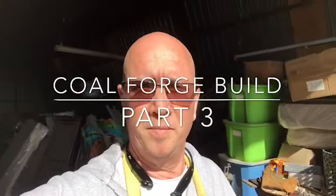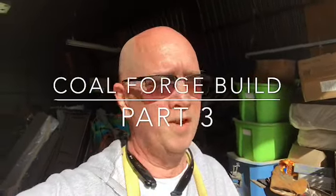Just working on a few things, a couple upgrades or finishing touches that I was supposed to be doing to my forge that I've been putting off. So now that I've created several pairs of tongs, I'm going to have to add a little handle spot or a bar across the side of the forge to hang my tongs on. And I never did extend the handle on the clinker breaker so that I could reach it from the front side of the forge. So I forged a couple pieces for that today that I'm gonna attach to the forge, and then I'm also working on another pair of these quick tongs that need to be finished off.